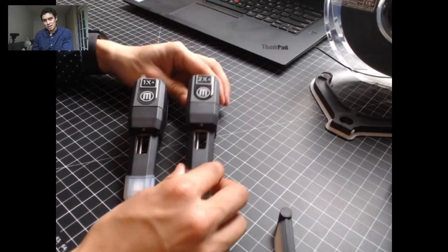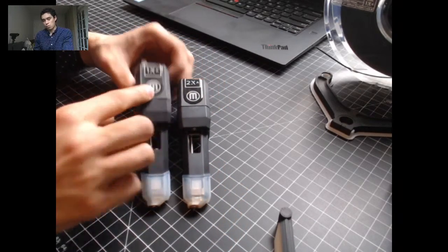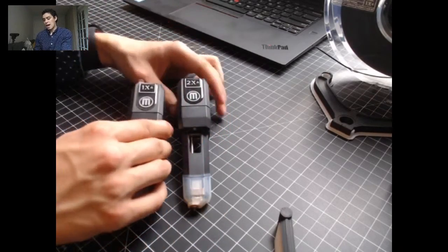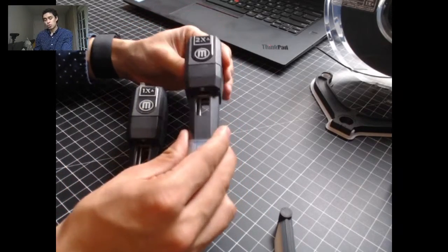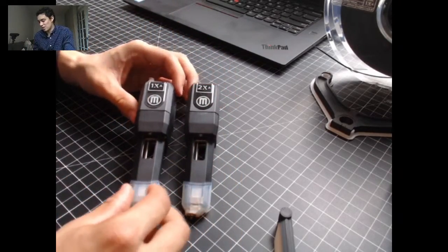And the 2XA, that's the companion extruder. So you have one extruder that's for model, so as you can see here, the model extruder or the 1XA extruder, and a secondary extruder that's for support. Let me try to highlight it here. Here we go, support, right? The support extruder is, as the name suggests, the one that you'll be printing the